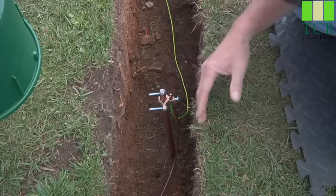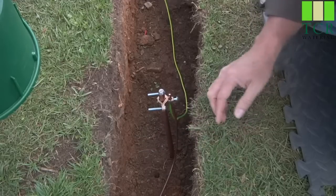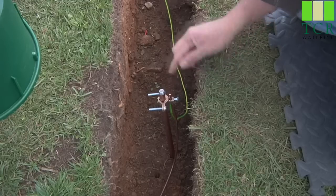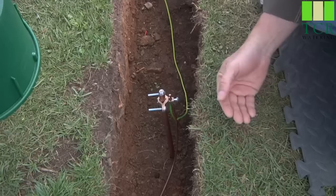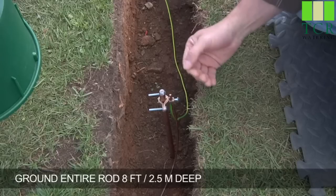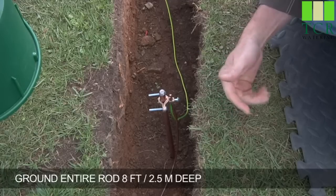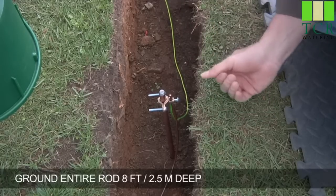You want to make sure that you don't have any sharp 90-degree bends in that grounding wire — always make a smooth, gentle, curving sweep. Here we've attached to an 8-foot or 2.5-meter ground rod driven completely into the ground. It's very important not to skimp on this ground rod. You'll want to bury the entire 8 feet, as the amount of earth contact with your rod is indicative of the level of grounding you'll achieve.